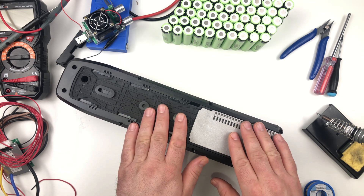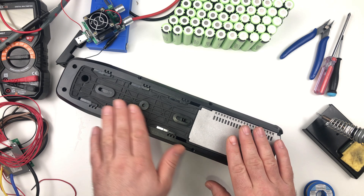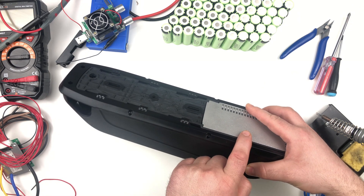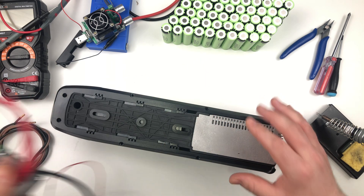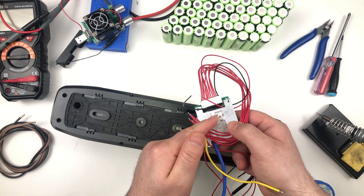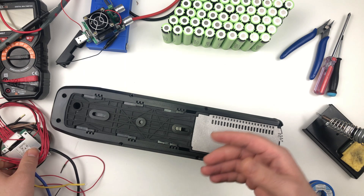In this video I will build my e-bike battery. I have a case ready that I purchased from AliExpress for $30. I chose this case because you can put a built-in controller for an e-bike. I have 50 Panasonic cells, a 20 amp BMS for 10 series. We're going to have 5 in parallel and 10 in series. Let's get started.